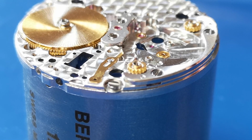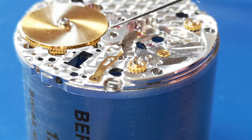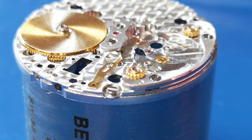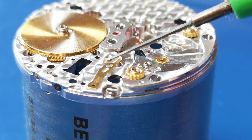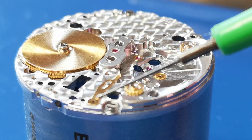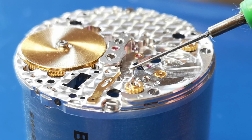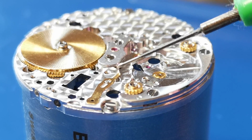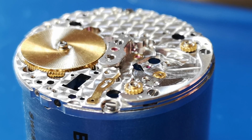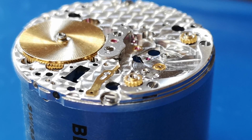Okay, so I'm now just starting the reassembly of this watch and just put in one component which I really like in this movement, and that is the balance hack, and that is this component here. Now, you know, this thing is just gonna work. It has a bridge along with some other winding components that go in here. It can't move anywhere. It's really simple design, and in this little hole here there's a pin from the setting lever, so when you pull the crown out it throws this forward, which then touches the edge of the balance here and stops it in its tracks. It's very simple. It runs across this post here. It can't go anywhere. It is gonna work. You know, the mean time between failure of that is going to be pretty high. So, you know, just another quick point about the design of this great movement by Rolex.